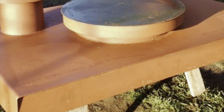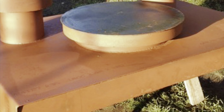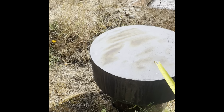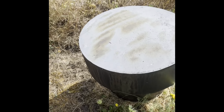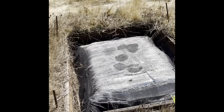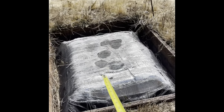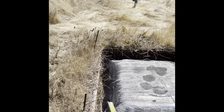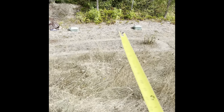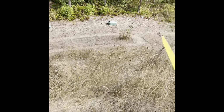This is the actual escape hatch and ventilation that I built on my next ones. I dropped this picture in to show you how I would do it. This is the old way, the one I did. This is the first structure I ever did, and it had the escape hatch on top of the structure. Whereas now I put it on the back of the structure and I hang it off the back wall, so that it has no interaction at all with the structure itself.